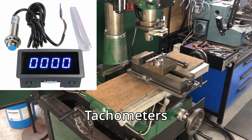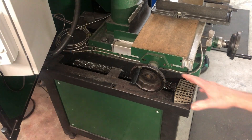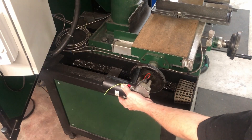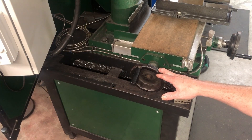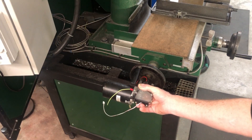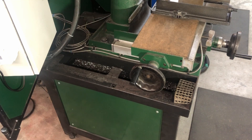I have the tachometers now so I can install one of those as well. Another thing I wanted to do is make a power feed for the x-axis, over here on this hand wheel. There'll be a motor similar to this one mounted here. I've seen a couple of videos where people have made shop-built power feeds - some can be quite technical because you need the mechanism to disengage so you can crank the hand wheel without turning the motor. The motor has a worm gear in it so you won't be able to turn it if it's connected permanently, so a little bit of thinking needs to go into that.